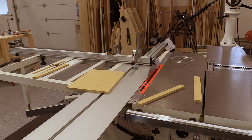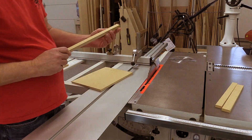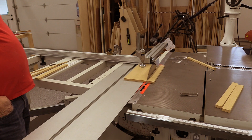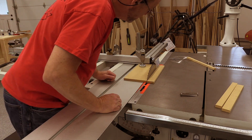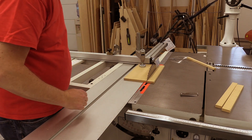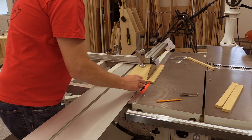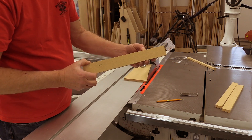In addition to examining the cut surface, we can also use our eyes and ears. As the MDF is pushed through the blade, you'll likely hear the back teeth when they start to cut the wood if your toe out is not neutral. You may also see sawdust flipping up in the air from either the left side or the right side of the blade.